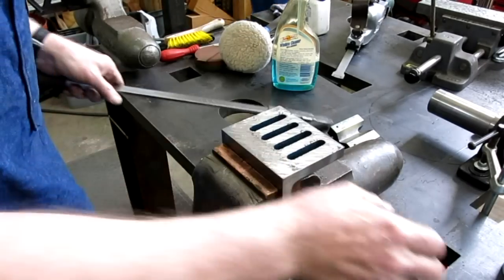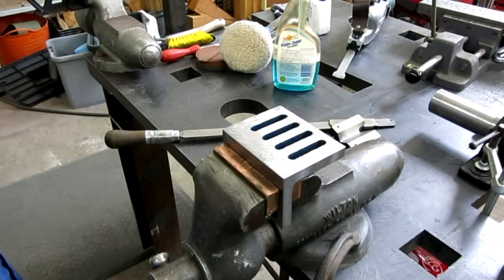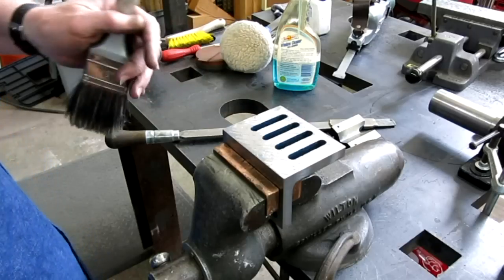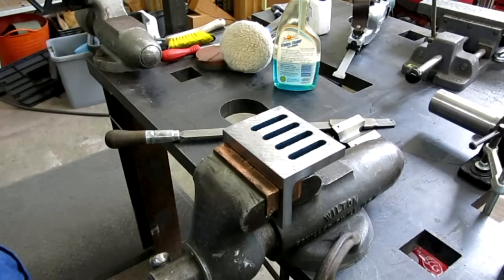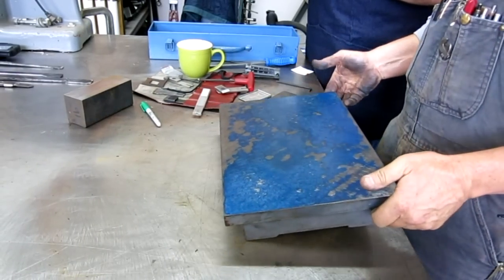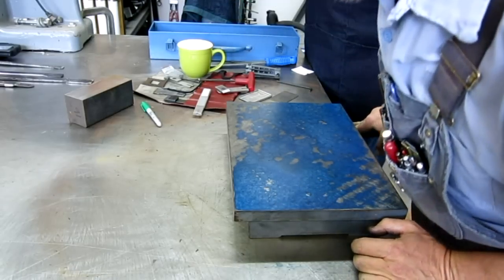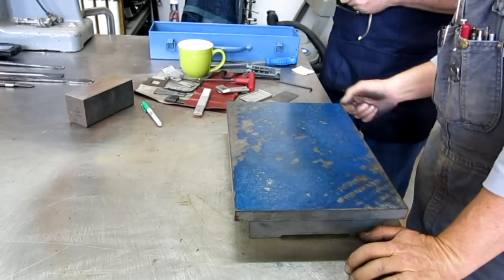That's hard reading. Now, are you doing both faces at the same time against that? No, I did put it against the angle block just to make sure where it is. But it's very close. Oh, it is. So I don't have to really mess with it. I do the big face, and then flip it over and do the other. Wow. Okay. It's one big spot. Oh, but there's a hard touchdown there, huh? That corner. That's where you get the silver, where it's polished off on the top.